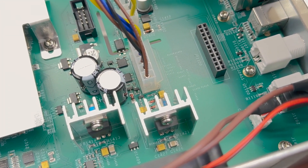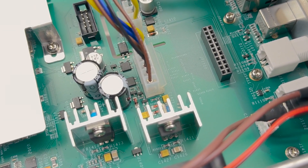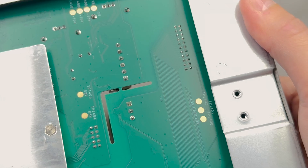These are an LM317 and an LM337, which are likely used to generate plus and minus 15V rails that power the entire analog section. If we look at the back we're going to see nice labeled test points for all of these voltages.